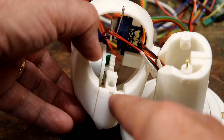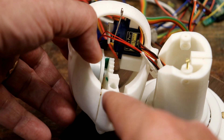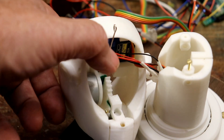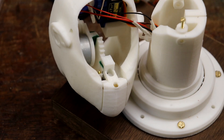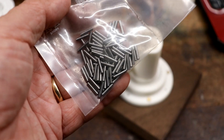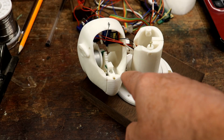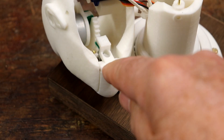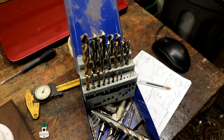As promised in the last video, I'm going to take her jaw apart because I've got an improved way of doing the axles. You can't use a solid length of metal because you can't get it into the little socket on either side since the body is solid. I thought: you could provide a piece of 2mm brass rod and cut it to size, or — I discovered you can get 10mm long by 2mm diameter little steel pins. They're readily available from various suppliers. I know they are exactly 10mm long and 2mm diameter, so I'm going to redesign the little socket where the axles lie with a small plastic spacer in the middle, so you can lay one in either side, put them in the holes, then screw the back on.